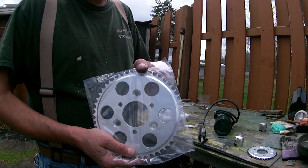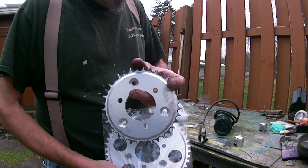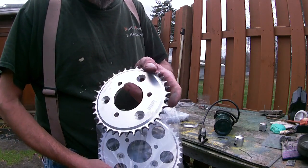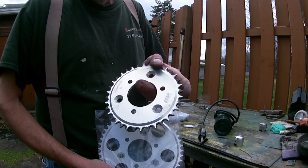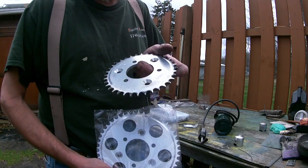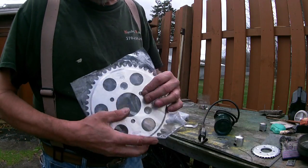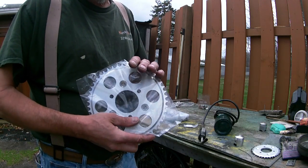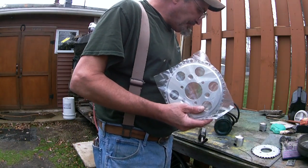When I tell you my bikes will reach this speed, sometimes I'll change to a smaller sprocket. But you're not going to get as much low-end torque. You're going to get more high-end once you get inertia up on the bike, and you're not really going to pull steep hills. I don't care what the two cycle's putting out. This is more utilitarian for where I live up here in Pennsylvania. There's a hill at every other block that you're going to.